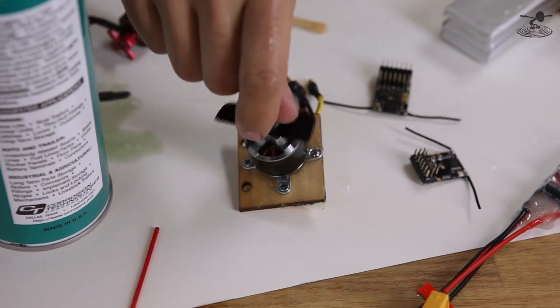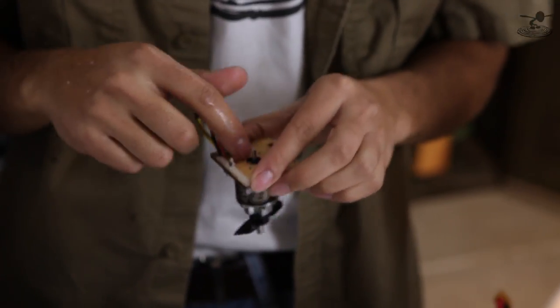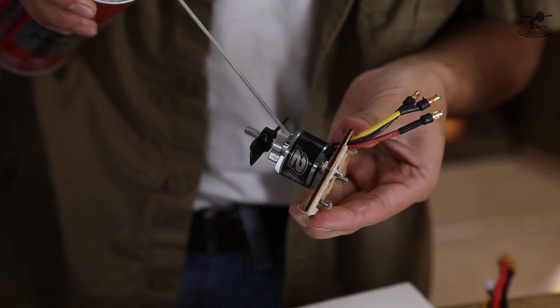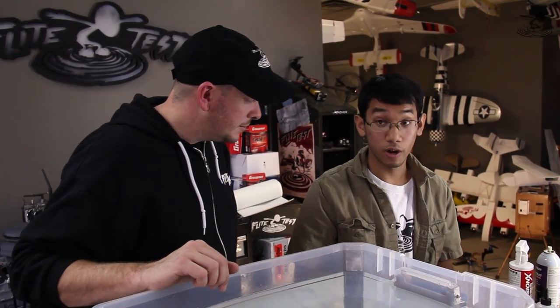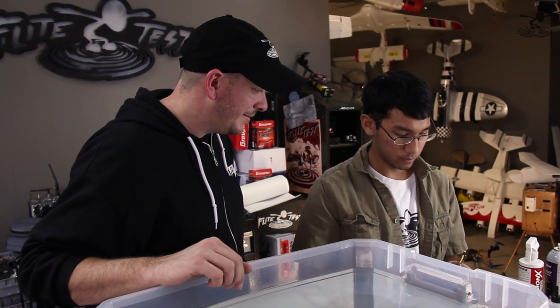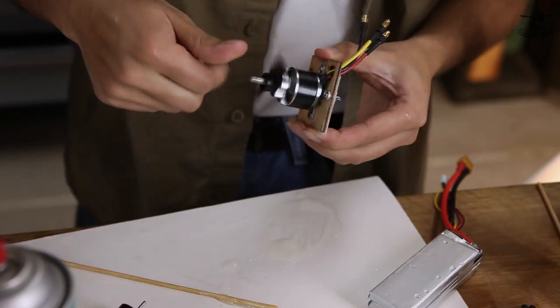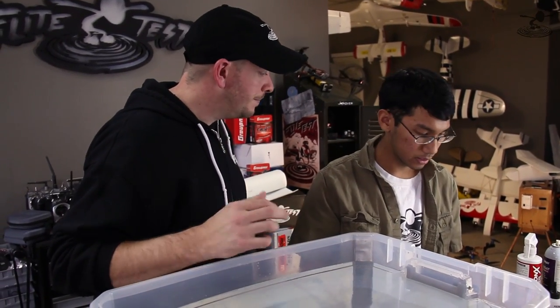For the last bit of this episode, we're going to show you about the motors too. Your brushless motor will actually just run completely wet — it's perfectly sealed. The only thing that's not really sealed is the bearings — they're susceptible to the elements, which is why I really like this stuff for bearings. Is this just like WD-40 on steroids? WD-40 on steroids — and this does not rust things. WD-40 will rust stuff because it displaces everything — it's Water Displacement 40. This stuff is a lot better for anyone wanting to run motors under water. You can coat your bullet connectors too — they're just pulses of energy, not constant current, and it just keeps them from rusting.